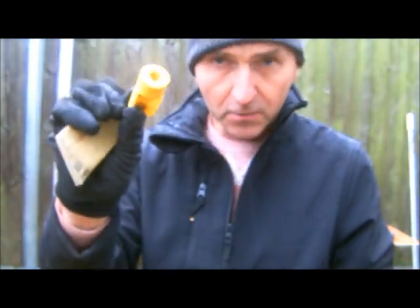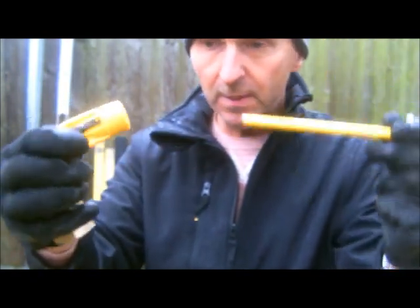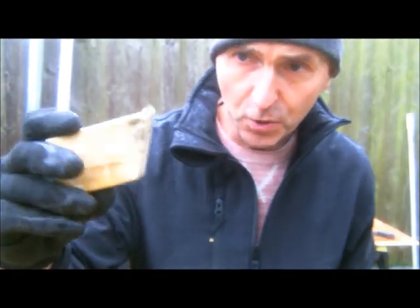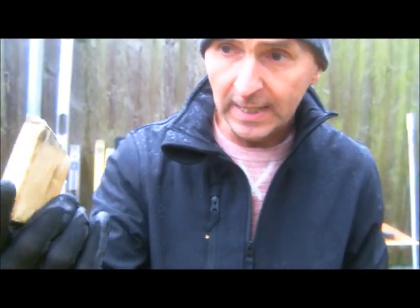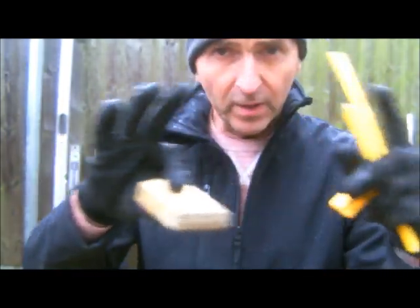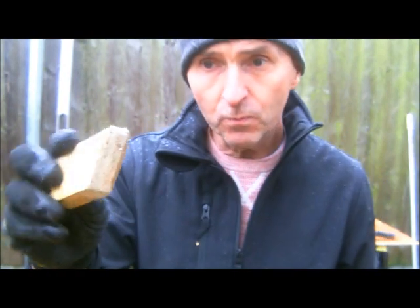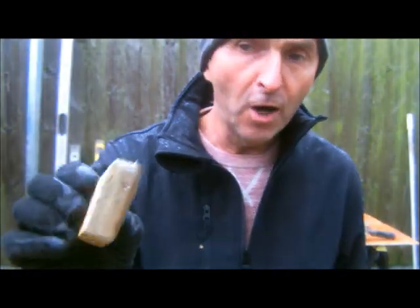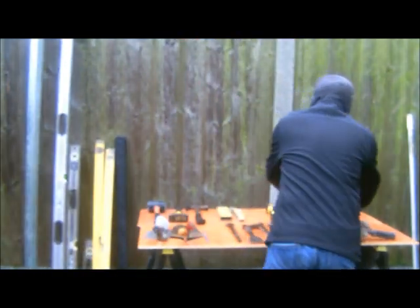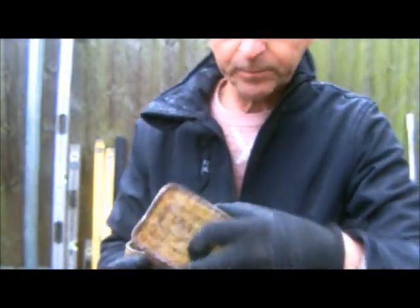Always have plenty of pencils and a sharpener — obviously the square carpenter-shape ones. I always have my piece of wood for flush jointing; if you look at the flush joint video you'll see this being used. On reclaimed bricks or ones with an uneven face you can't use a joint iron, so a flush joint piece of wood is the best way I find for getting a flush joint.